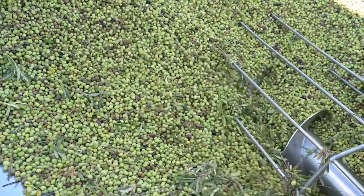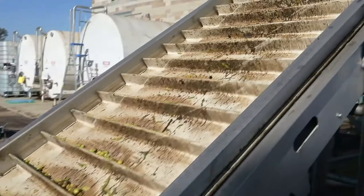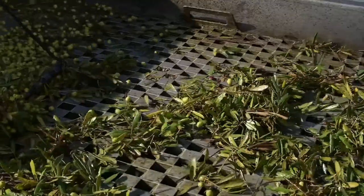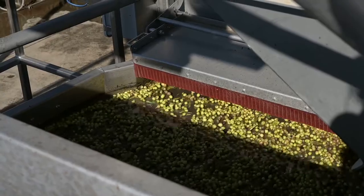When the olives arrive at the mill, the truck gets weighed for gross weight, then gets pulled around to our gantry crane and dumped into the hopper. From the hopper the olives are conveyed up into what we call a scalper — a double-deck vibratory table with a grid on top. The olives fall through the grid and all big sticks and twigs go across the top and get sorted out. From that machine the olives go to our photo eye sorter, which removes more trash and mummies — a mummy being a piece of fruit left over from the prior year — and anything not color-oriented with an olive gets kicked out.